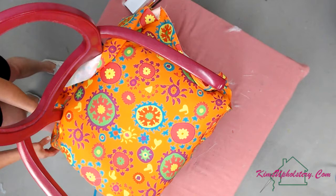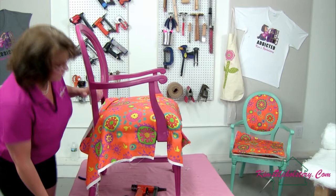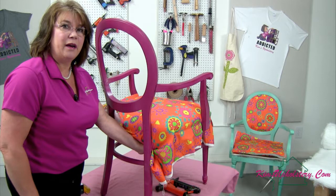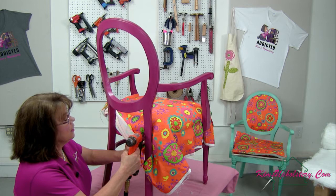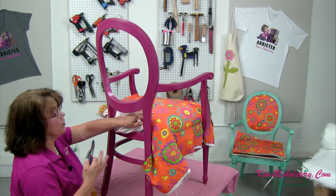We're going to tuck our little tail. Look at that — perfect first time, which is exactly what we want with this kind of cut, because if it wasn't we'd be putting on new fabric. So if I spin this around, you can see that by the way I made my cuts, I now have some excess fabric to fold back and a finished edge against my upright posts. Let's go ahead and get this back one stapled down. I'm going to get one staple up close to the edge of the back post here — you just have to feel where that ledge of the frame is.